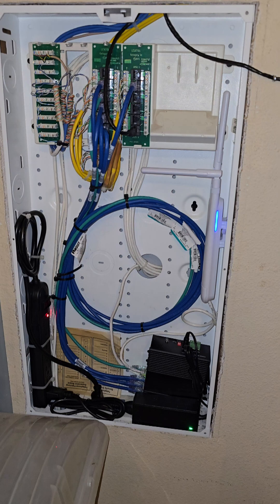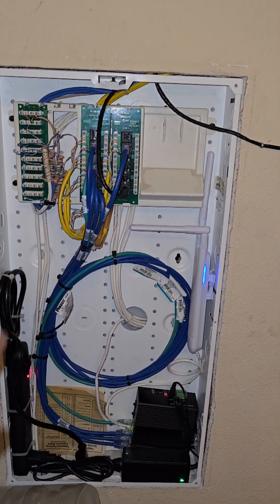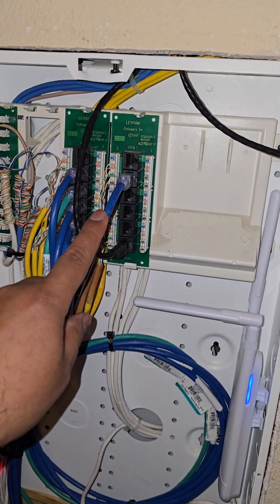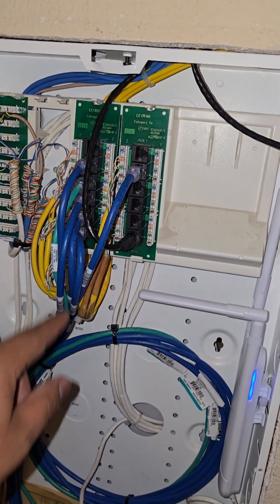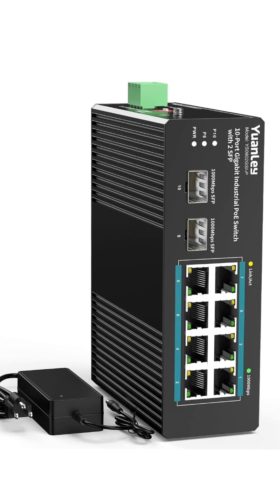Here's what I could do without tools. I got the very basic tools needed to do this job and we were able to reuse the customer's voice and data modules with a bracket from Leviton. These are six-port Cat5e modules, and we went ahead and ran new Cat6 cables from those Cat5e modules down to a new hardened switch.